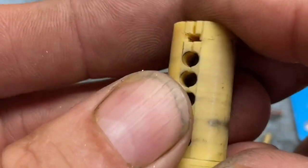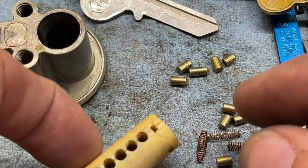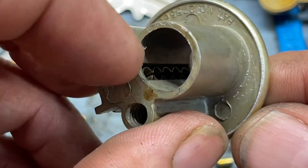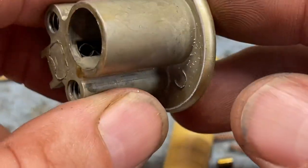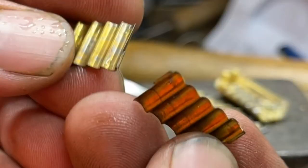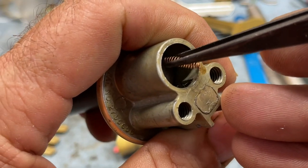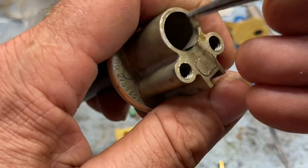That's an interesting design with the split-apart plug. I just wanted to show you the split core and the unusual upper chambers. I'd like to pull those out to show you closer, but they're just little red wave-bent pieces - probably stamped out in a press and shoved down in there. You can see the ends of them right there - just pieces of metal stamped and formed into U-shapes, two of them stuck in there. Now let me get this back together. It's a little tricky getting the springs and top pins back in because they're not sitting still.